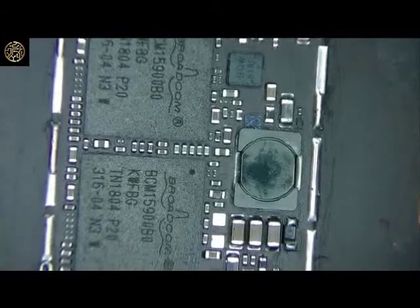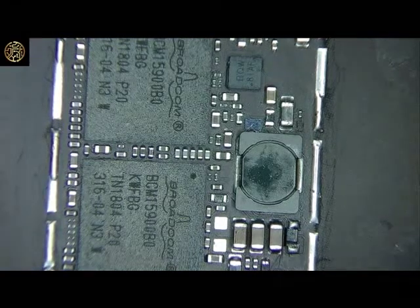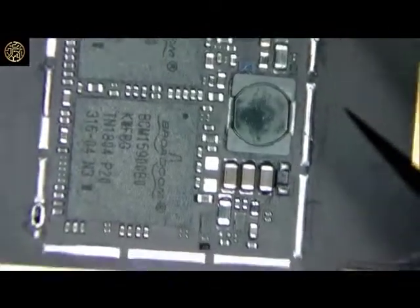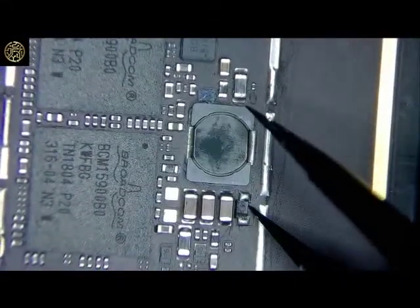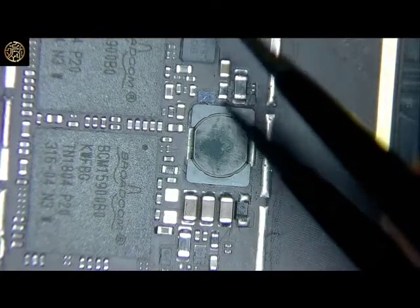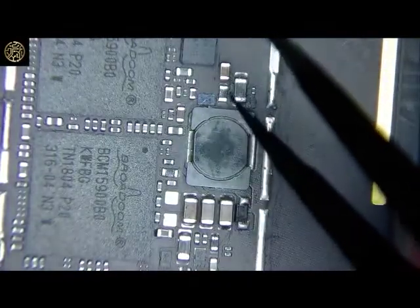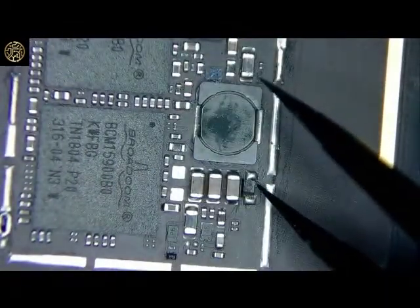So I said, let me plug it in and take a look at the thermal camera. Having this thermal camera has made a lot of difference — both when things get fixed and when they don't — especially the time it takes to diagnose. When I hooked it up to power it started to boot, and about halfway through the boot cycle this diode here, the cap here, and the resistor here started lighting up. Once it got a little past halfway through, they stopped and never lit up again once it was fully booted.